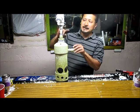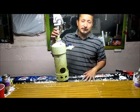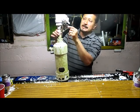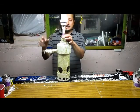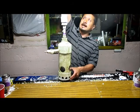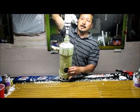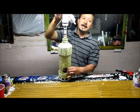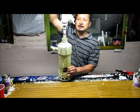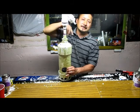It works really well — watch my previous video. But I needed more water flow for my tilapia. I set it and forget it, it keeps itself clean, but I wanted more flow, so I bought these fittings. I think this was about a dollar seventy, the adapters were a dollar twelve, half inch fittings about 28 cents, and this hose adapter was a dollar nineteen. The theory is this whole assembly sits at the bottom of the pond submerged underwater, then inch and a half pipe goes up out of the water. The air still blows through here, but water is also being pushed in through this side port. With just the airlift and inch and a half pipe it'll only lift maybe six inches out of the water, and I need about four feet of lift.